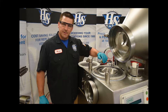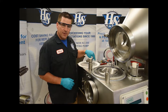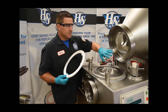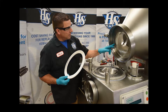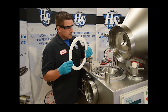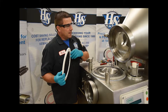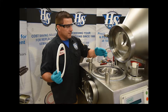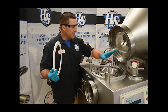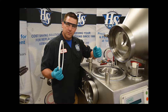We're ready to do our final assembly here. I'm going to start up here at the top of the hopper and install the slide ring. This particular unit did not have any shims under the slide ring, because there are also shims that go between the bottom of the hopper and the slide ring.